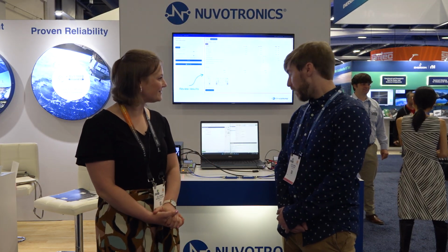So I hear you have a demo for us today. Can you tell us what we're about to see and give us a few details on it? Yeah. So we're going over our sub-octave multiplexer line. We have several options: 3, 5, and 4 banded sub-octave multiplexers. The main benefit for sub-octave is it suppresses out-of-band interferers and intermod products. And with the polystrata technology we have, you really don't have to sacrifice for insertion loss whenever you add it before all the active components in your circuit, and you get really good rejection in noisy environments. So we're going to try to show that off today.